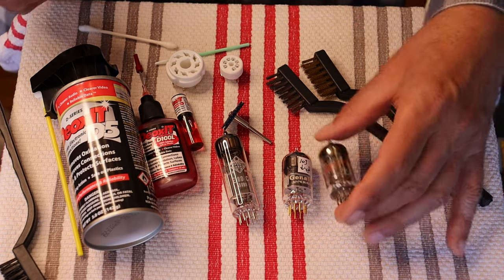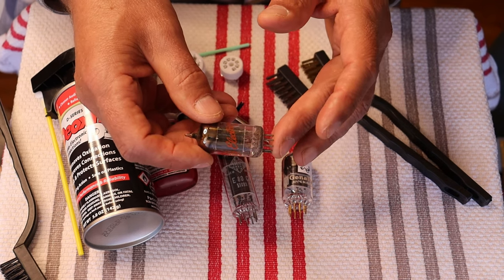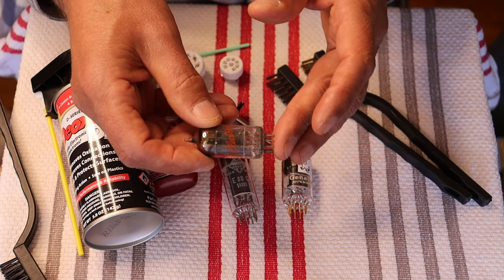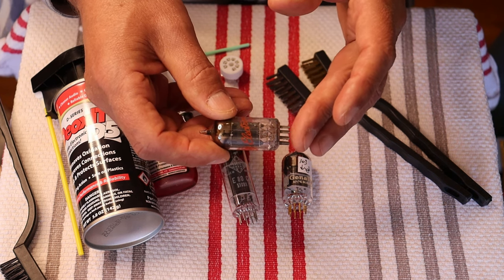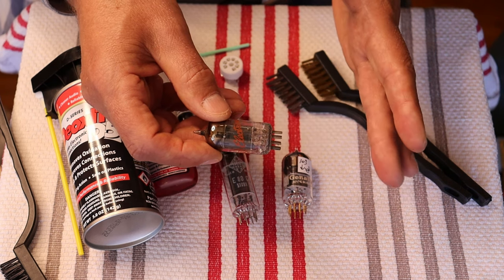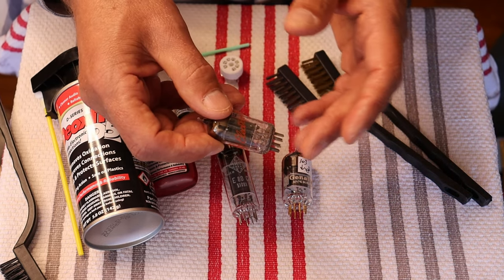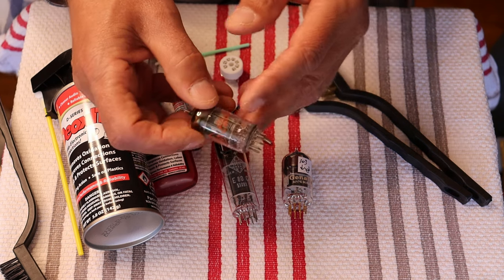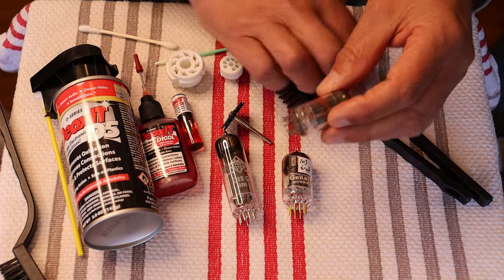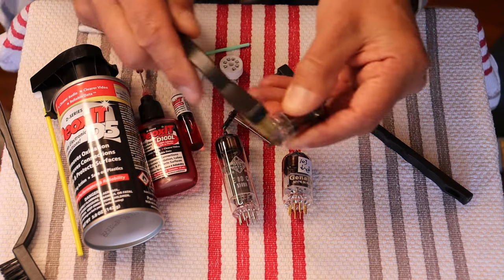The vast majority of miniature nine pins are basically a brass pin of some kind, some alloy, and they will tarnish readily. Even a new old stock tube will tarnish readily over time. That's not a sign of a defect — it'll just oxidize in oxygen. The metallurgy of the pin may well contribute to the oxidization. So with that, you want to be a little more aggressive. If you don't have a Dremel tool, you could start with the brass brush.